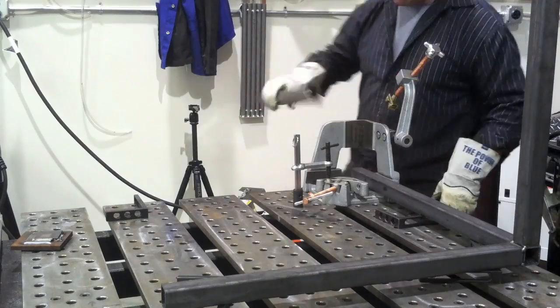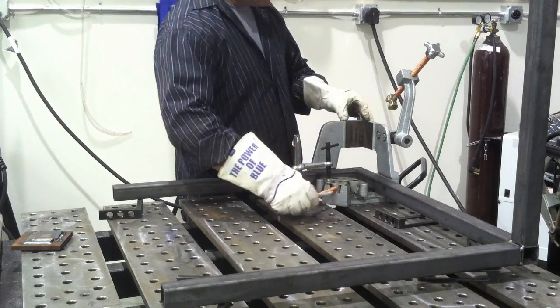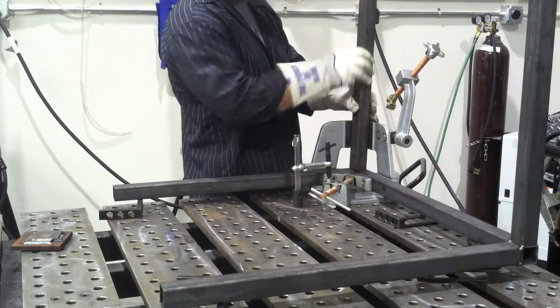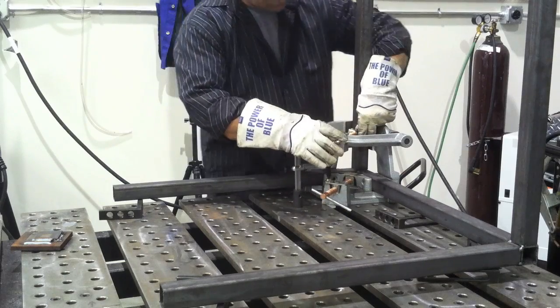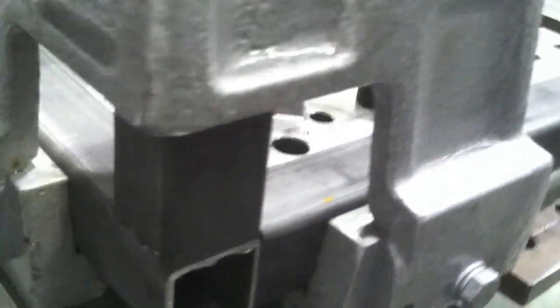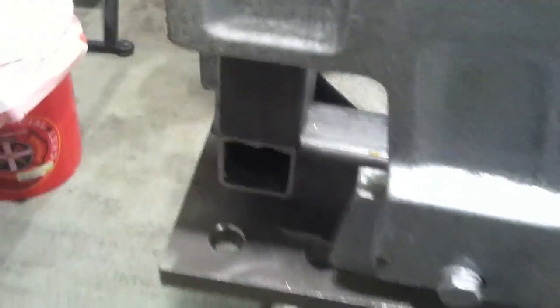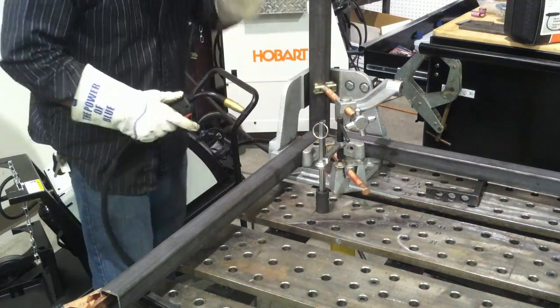I'm framing up a box here — it's going to be the main framework for this cutting table, and I've got square cut ends. I didn't miter anything, partly because the saw angle cutter is frozen shut, but also partly because it's part of the design. I'm going to put some pipe up in some of these open ends on the top to make a telescoping handle that holds parts or light angle iron for plasma cutting. Once you get everything locked in, there are quick-release buttons and access ports for tack welding. I usually just get plenty of tacks and move on to the next joint so that if I make a mistake I can break something loose without having to redo the whole thing.